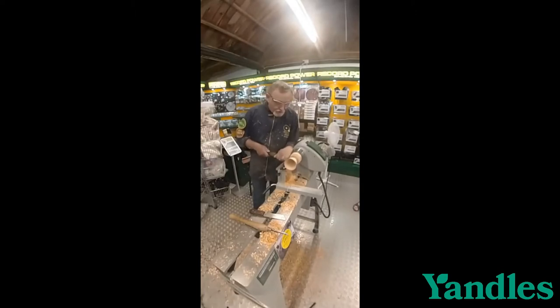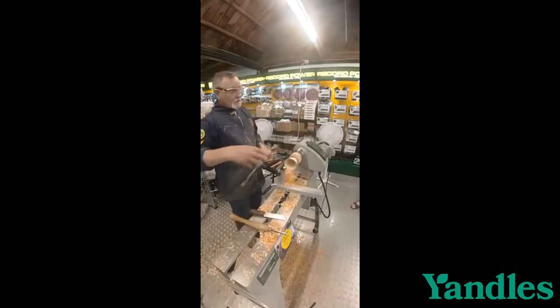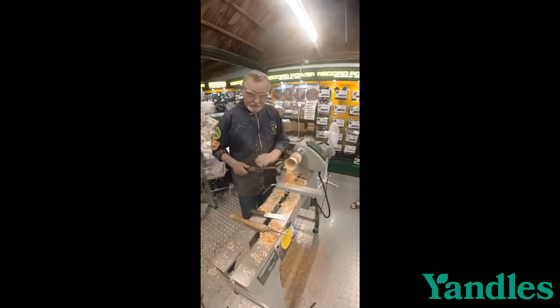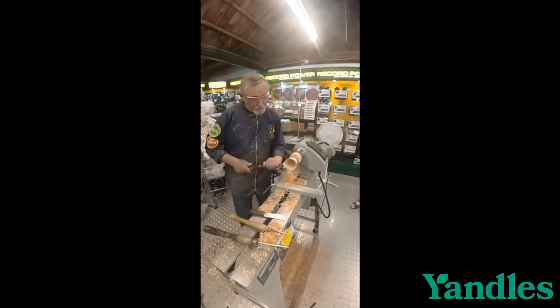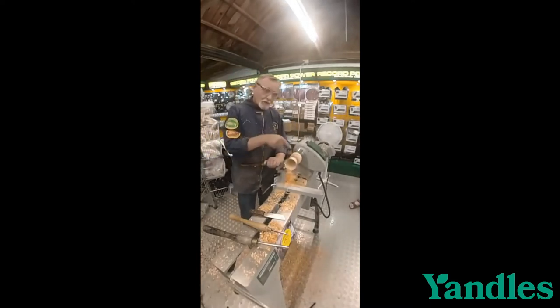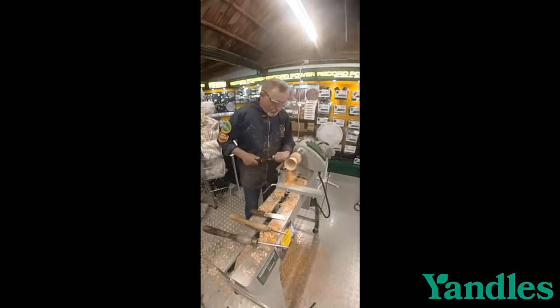When you're cutting across the bottom or top of something, always clear the wood you're not using, that you don't want. Get rid of it. Let's just grab a skew for a second. If you're trying to push a skew round the end of something and you've still got the live centre and a tag of wood, and you're being pushed against what you want, you're going to burnish it. You're going to burnish it so deep you are never going to abrade that out. So always get rid of what you don't want and then work on what you've got left.